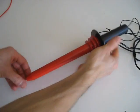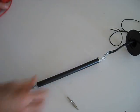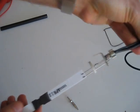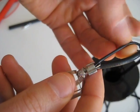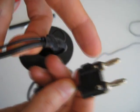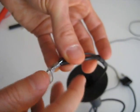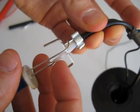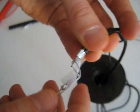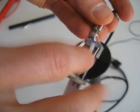Just take it apart here. So here we have two thin film resistors. I'll just give you a close up of this section here. I've got the ground clip wire here, which connects to all this metal here. Then I've got the other cable which has the two wires for the banana plugs — the positive and the ground banana plug. The ground banana plug also connects to this section right here, so it's connected to the ground as well. The positive goes to this plastic tube, which then continues down here to the resistor. And the ground also continues here, supposedly to another resistor. I'm guessing the spacing right here is probably set for arcing, so if there is an arc it'll go here and then to ground instead of to the meter.